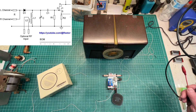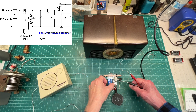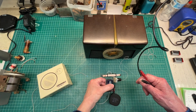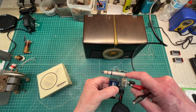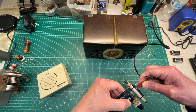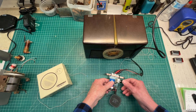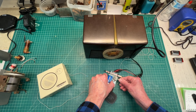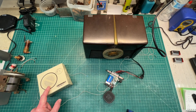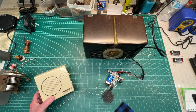I also took three turns of magnet wire on the ground side of the ferrite and have that attached. I have two direct connection points as well for that coil — you can see in red and black. Hook those up to the signal generator and transmit the signal that way. Also, just varying the RF signal generator amplitude and frequency, and tweaking the capacitor on the tuned circuit back to the ferrite antenna.